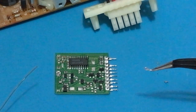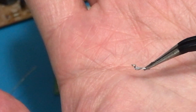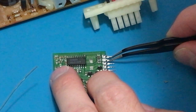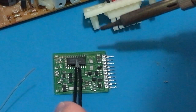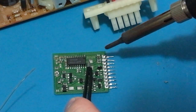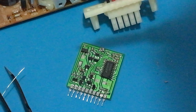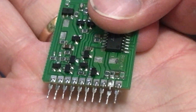I have to get this leg onto the daughter board before we continue. I made several attempts — it kept coming off, so this was not easy. It has a little leg that's supposed to go on the back as well, but that came off. I was just hoping to solder it straight to the daughter board without it going through the back as the other pins do. I'm afraid that when I solder the daughter board onto the PCB it may come loose again with the heat, but finally it seems to be well stuck on and it looks pretty good.